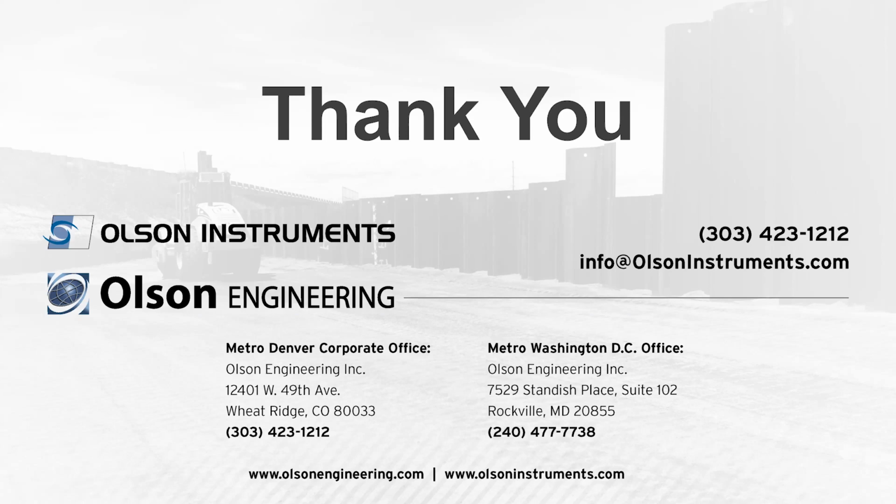Yeah, Pat did some research on this. Typically the effective depth, the rule of thumb, is 1 to 1.5 plate diameters. That was one of the things we looked at when we buried the stress and strain transducers in the ground, and the conclusions from that research were indeed that that's right in the ballpark, 1 to 1.5 plate diameters.